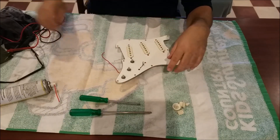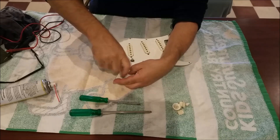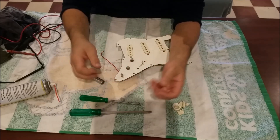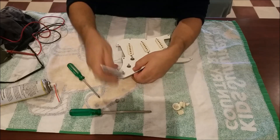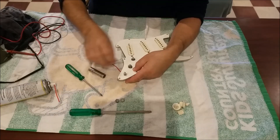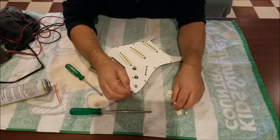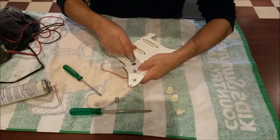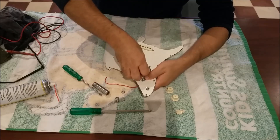I'm going to pull this apart - it's gross and it needs a good clean. I'm just going to use a tube socket. That is just messed up - it's so full of stuff. That's gross - I'm actually going to drop them in thinners. All the fasteners on this thing are just foul. For the knobs themselves, they're yellowed, a bit like a computer case. There's a guy that refurbs computer stuff and he retro-brights them - it's just peroxide. You soak them in peroxide, wrap them in Glad Wrap, and on a nice hot day leave them out in full sun and it bleaches them back to their original colour.